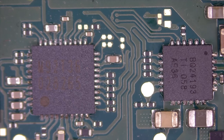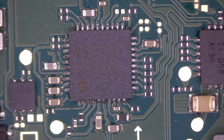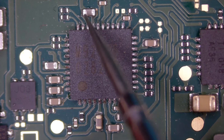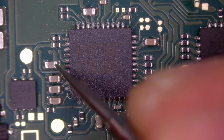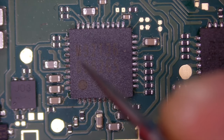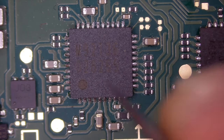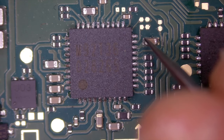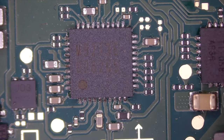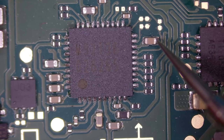Let's probe around. Let's first check those two ICs. Meter in diode mode. Okay, red probe on ground. I will use the USB-C port as ground. And let's check. If you're not familiar, in diode mode, one side will give a short beep, called the voltage drop, and the other side is connected directly to ground, and this side will beep. Those brown ones are capacitors. One side, one beep you can hear, and this side, continuous. That's the way I check this. If I have a continuous beep on both sides, I know there's something wrong.